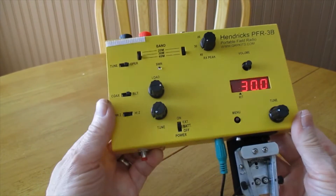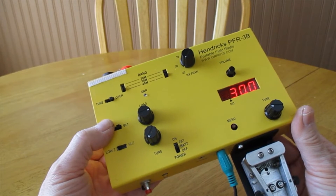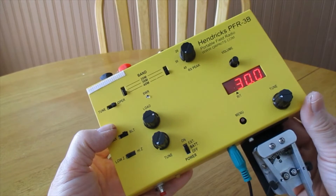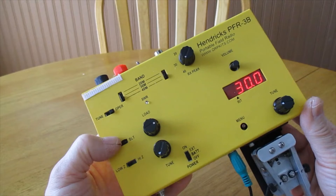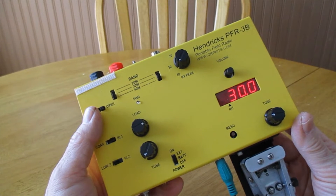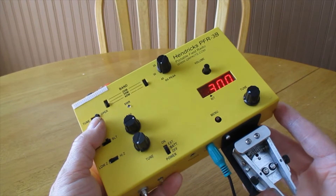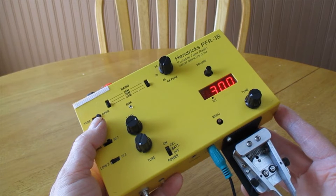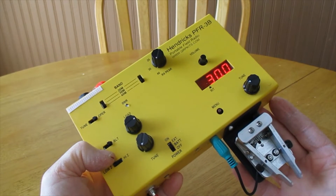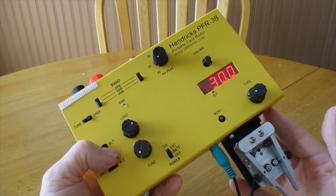It's a nice radio. It's not the lightest or smallest compared to the KX-1 and MTR-3B, but it's certainly nice. If you just want to go out and play on a nice summer day, throw a 35-foot wire and a 17-foot counterpoise out and you're set to go. It has an internal keyer with a 5 to 40 words-per-minute range, and it's really miserly on power draw — on receive only, around 40 to 45 mA, so it runs a long time on internal batteries.